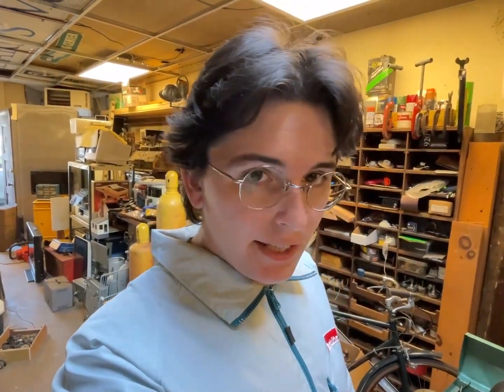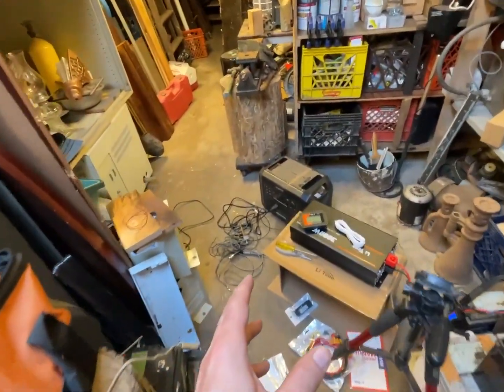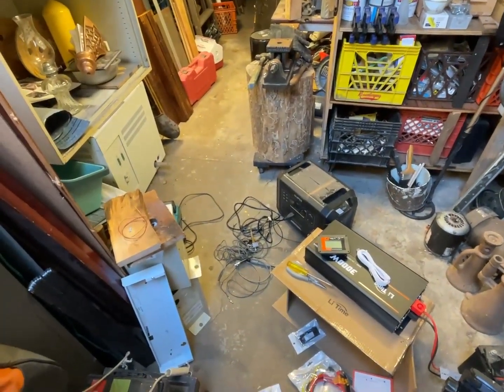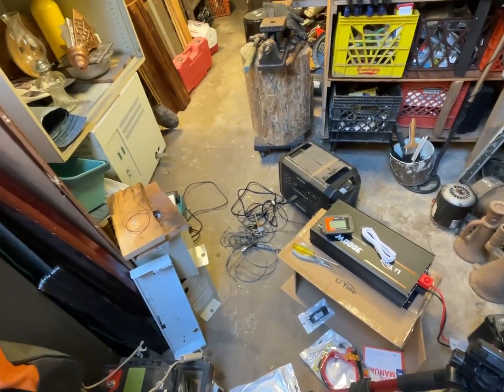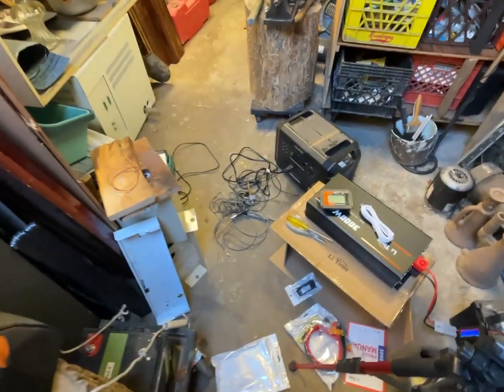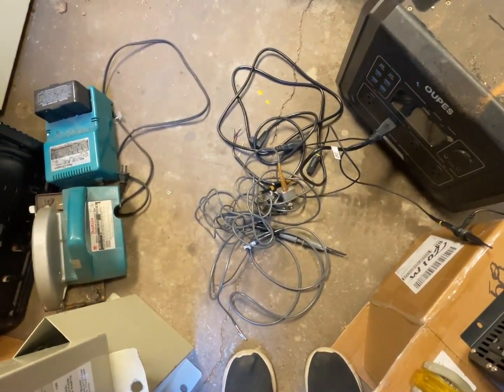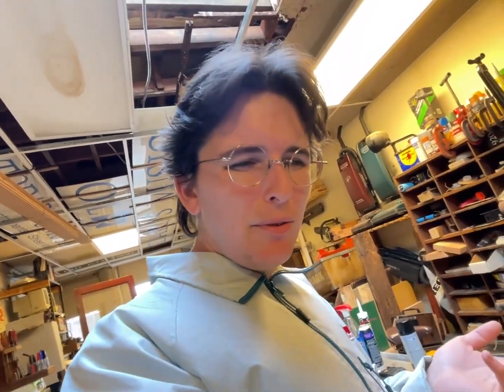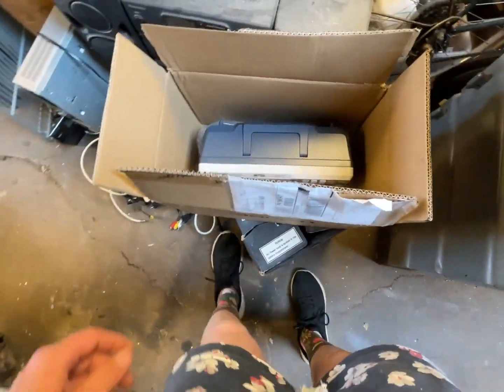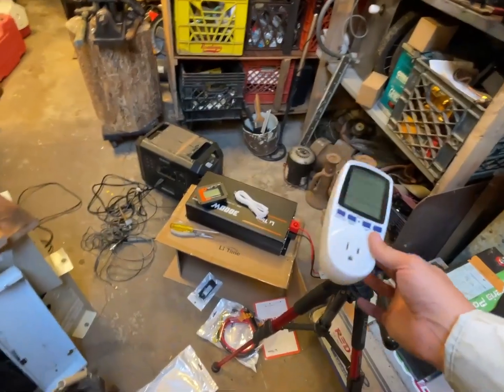It got really hot today, in the 90s Fahrenheit, and I couldn't really do a whole lot in the shop. I tried to find a 100x probe to use with my new oscilloscope, but it turns out I only have 10x probes — I think I bought a 100x probe back in Illinois and lost it, maybe it's in my barn there. I went digging and found all my probes are 10x. I could try measuring through a variac, but at 1x the scope would max out around 30 volts and I don't want to fry it. So I went back home and got my watt meter to measure both ends of this thing.